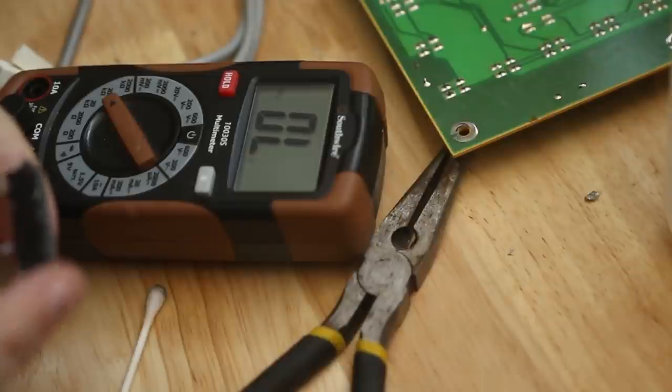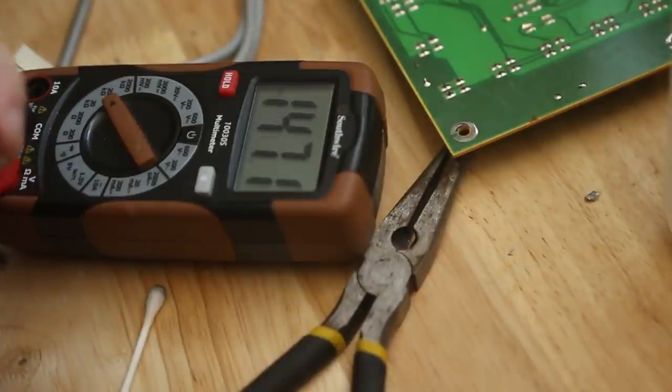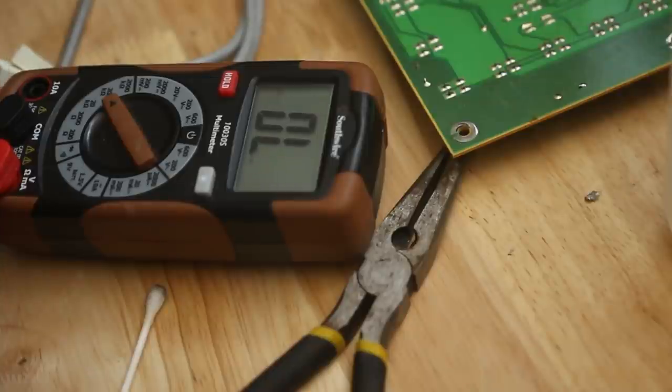Anyway, if I'm editing this the right way, what you'll see is me measuring the full length of the conductive track. And so it should be 10K ohms, but one of them was reading all the way up at 120, which is way too high. And it's reading extra resistance because there's junk on the conductive faders that the signal is also trying to go through. It's also trying to go through that oxidation, or maybe the connection is just barely there in some traces and it's going through more track than it would have otherwise. Some of that's conjecture, some of that's fact, but the point is they were reading way out of spec.